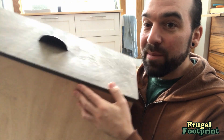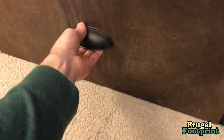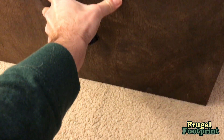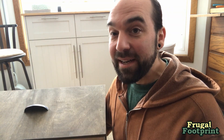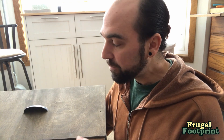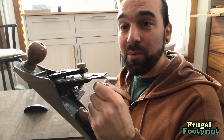When I designed and built this thing originally, we had hardwood floors, and we moved recently, and our bedroom now has carpet. It turns out that you're going to need quite a bit more clearance on the bottom of the drawers in order to get them open. As you can see here, they are quite difficult to open and close with the carpet, so we need to add a little bit of extra clearance. If you already have carpet and want to build this bed frame, I recommend cutting the bottom of the drawer just slightly shorter so you don't have to deal with this. But if you move from somewhere that has hardwood to somewhere that has carpet, like I did, I'm going to show you how to do this with a wood planer.